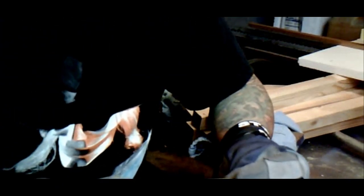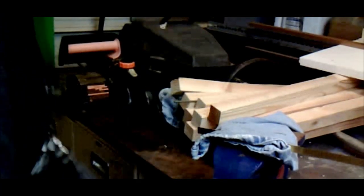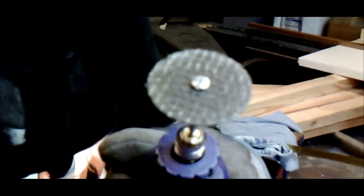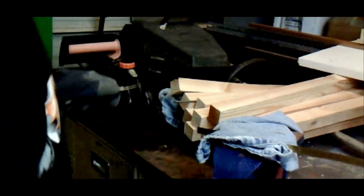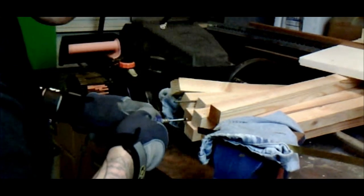I have taken this 1/16th brass plate here and measured it already, marked it off about 5/8 inch each spot using a little template I made earlier. Basically we're going to cut this apart, then grind it down and drill holes into it so that those little ball joints we made earlier are going to rest up inside there — this is going to hold it all together. So I'm going to secure this in the vise and take the Dremel tool with a cut wheel on it and cut this apart.